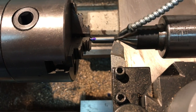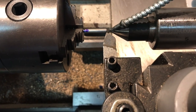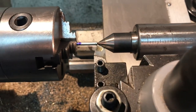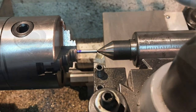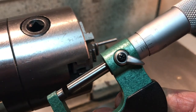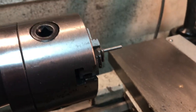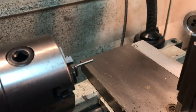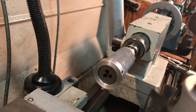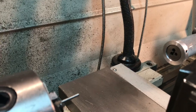I'm going to put a little drop of way oil on that because it's not a rotating steady. I'm going to turn that down to an eighth inch now and then thread it. That method worked out really nicely — I got a good finish and it's consistent. I checked the measurement at several places along the line and it's just one thou under, which will be perfect for threading with the tailstock die holder. I put a brand new unused 5-40 die in the tailstock die holder and it came out nice — the threads came out nice.